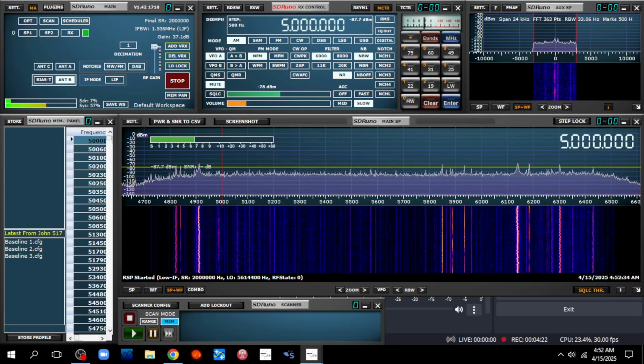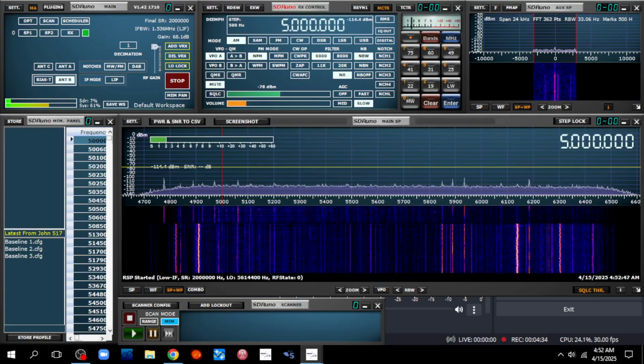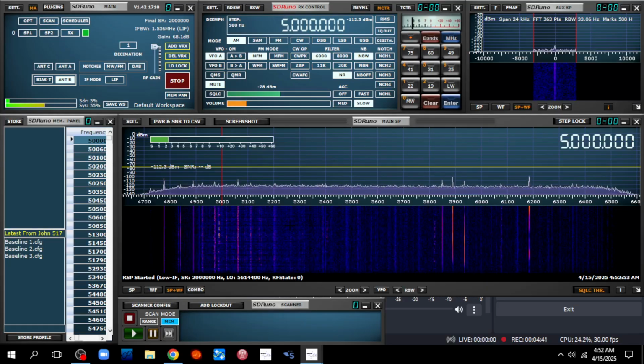Now, I'm just going to switch to the MFJ vertical antenna. It has no amplifier or anything. Okay, I'm switching right now. Noise level is very low, but you also notice the signal level went way down. Let me turn the audio up. I don't think you can hear WWV. No. So that has the advantage in that it's outside, and it's at the end of the wire, which goes up a telescopic fiberglass pole, 31 feet in the air.